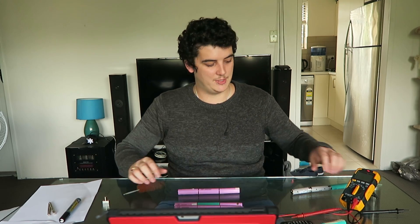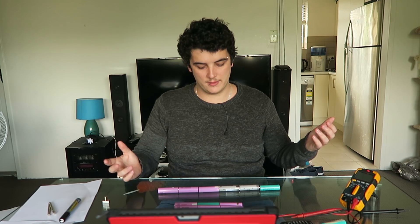That's basically it — that's how you wire up 18650 cells for anything. It's the same principle for any voltage. If you need 100 volts, it's the exact same — you're just going to need a lot more cells in series and it's going to be a very big battery. Thanks for watching.